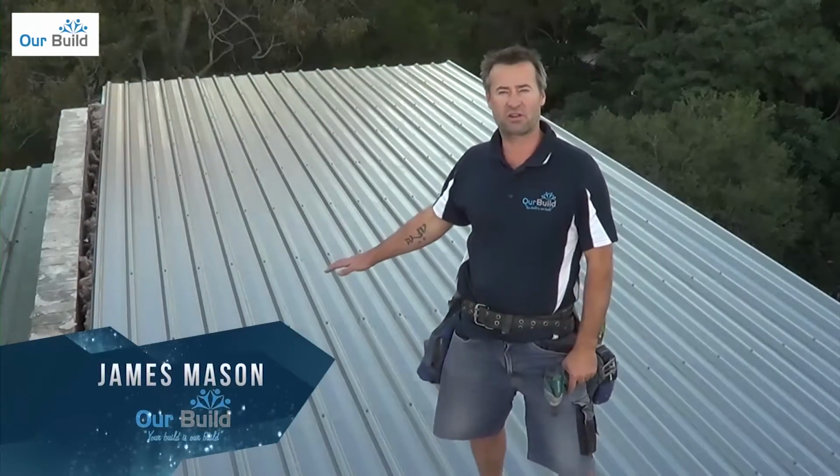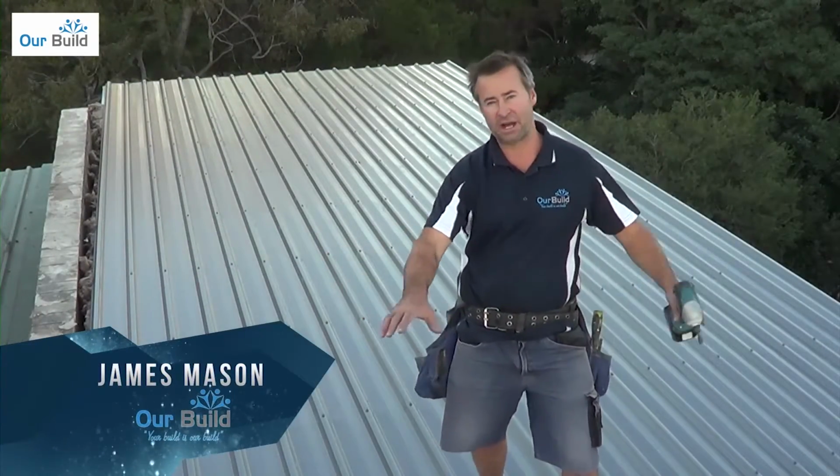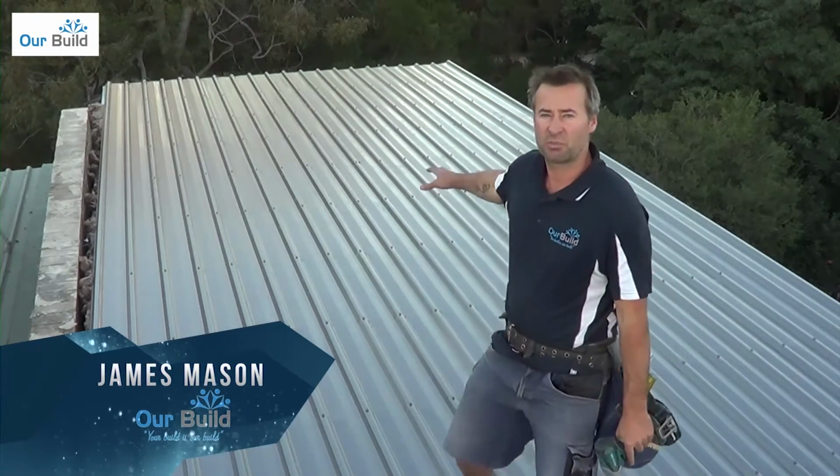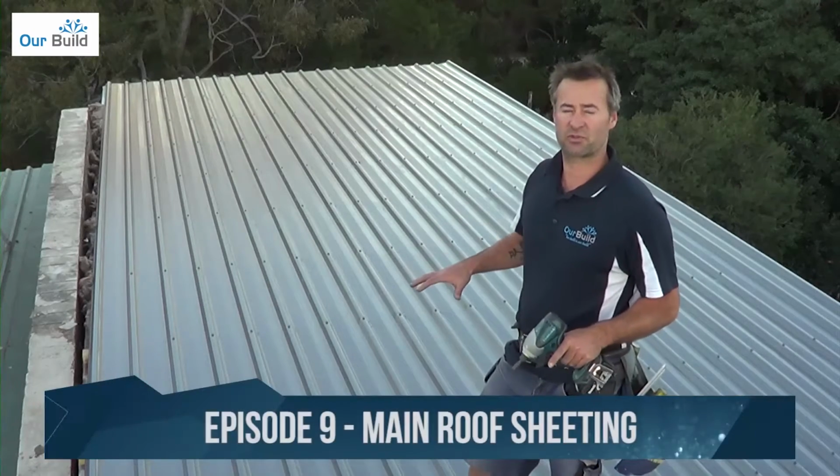Okay, so that's our roof deck on. All we've got to do now is run our barge cappings down each side, put a little apron flashing up the top here, pop the gutter on at the end, and that's the back of this roof complete.